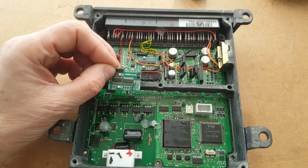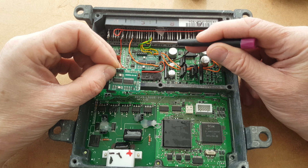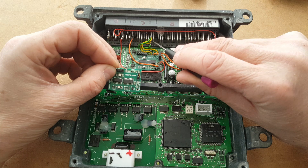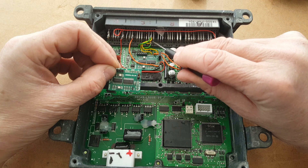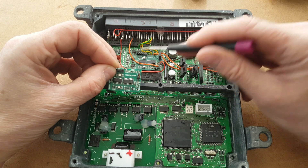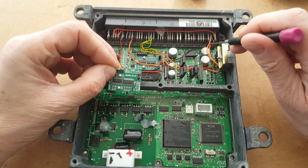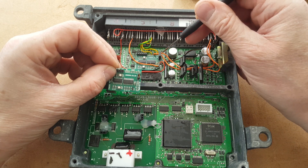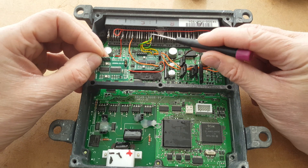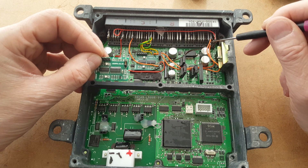It's basically exactly the same for the next three pins, which are the outputs. We've got a green wire that goes to the other half of that first outer pin. The yellow wire goes to the slightly more difficult to access middle pin behind it. So essentially each pin will have two wires connected to it — an input coming in and an output going back into the board. The orange wire for the output connects to the pin on the far end of the circuit board. Those are the three pins you need to cut; two are one behind the other, slightly more difficult, and one is easy to access.